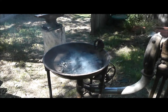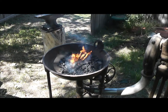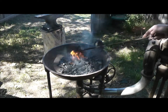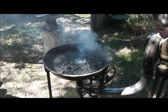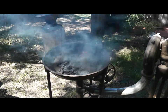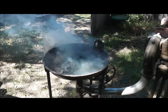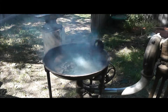One thing I've found out in the short time I've been doing this is you've got to coke the fire. A more accurate description is you have to coke the fire — you can't just start blacksmithing right away because you're going to have to drive out some of these impurities, namely sulfur, moisture, things like that. Depending on the grade of coal you get, you can have a lot of these impurities or not very much. We've got to get her going and let it coke a little while, see how much smoke we've got. I've come up with something to deal with that smoke, which I'll show in just a minute.